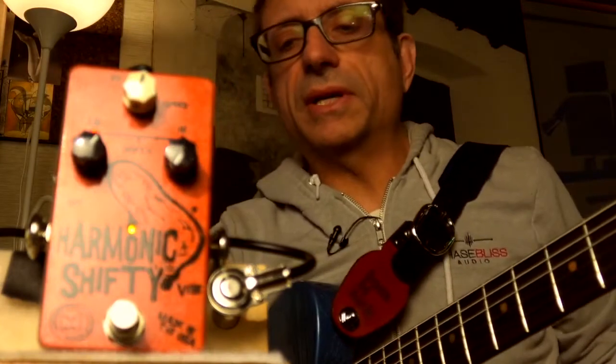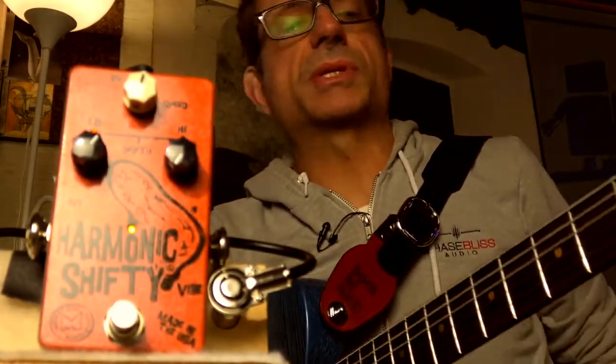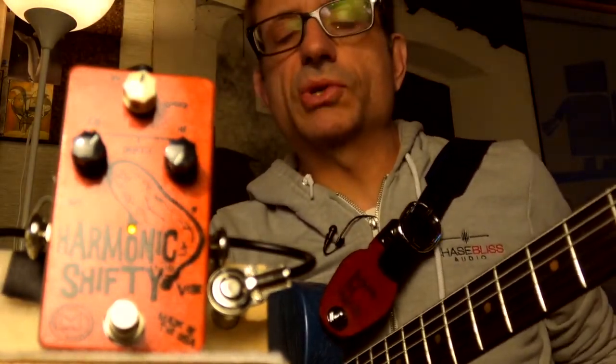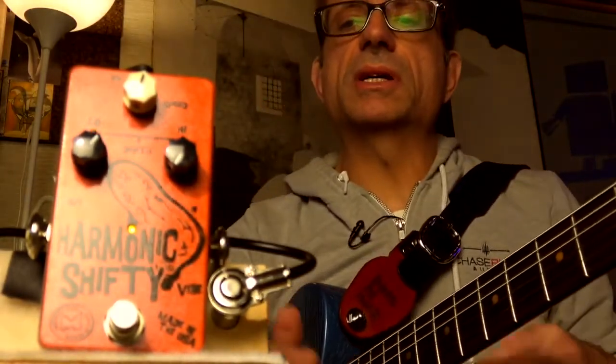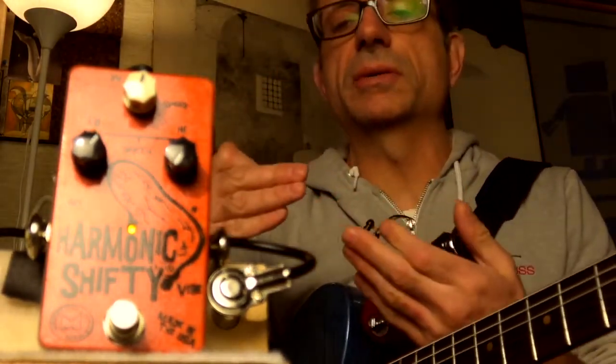Harmonic tremolo is an effect that first came out on some amps in the early and mid 60s. And it's distinguished from a tremolo by the fact that the signal is divided into a high and low frequency band, and those are modulated independently.